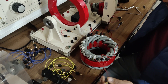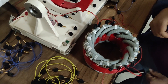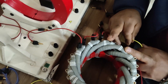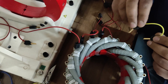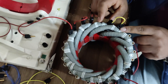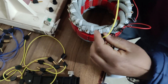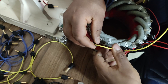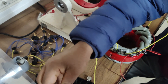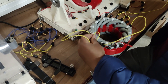So this is how we have designed the R-phase of this machine, connecting four coils in two series pairs. The remaining terminal becomes the start and the other the end, depending on whether we connect in star or delta. Similarly, we design the yellow phase using coil number 2 and coil number 3 in series. We connect the end terminal of coil number 2 with the start terminal of coil number 3, then connect the end terminal of coil number 3 to the start of coil number 8, and connect coil number 8 and coil number 9 in series.